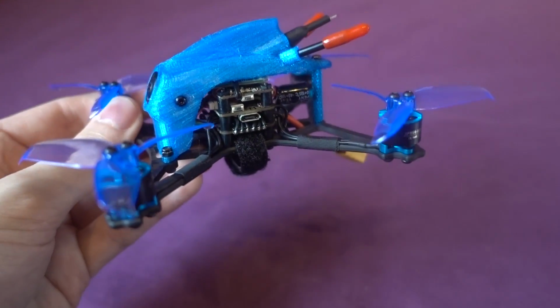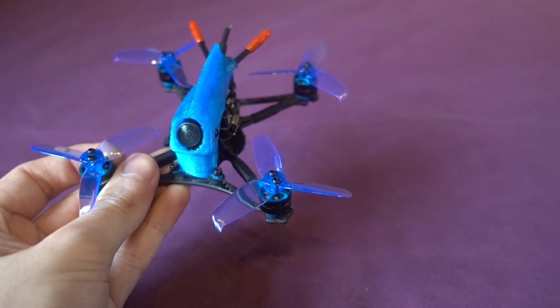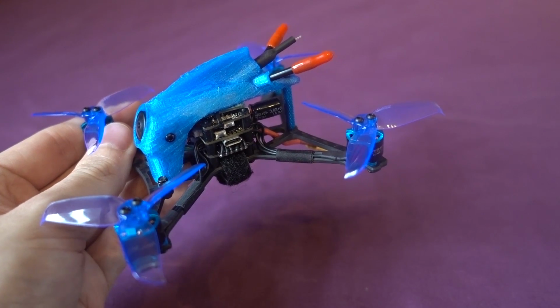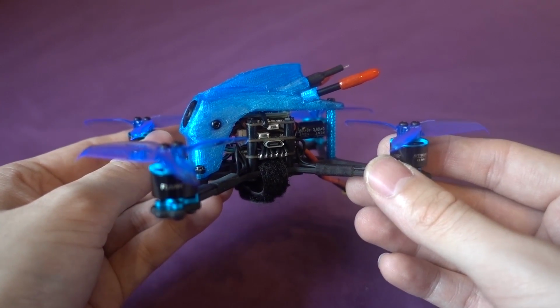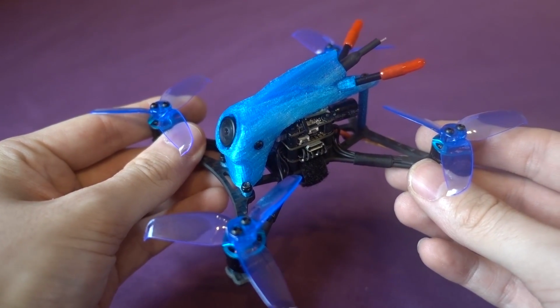But bear in mind, you can build 2 identical quads and the PIDs still need to be different. I haven't touched the filters because messing around with filters could be fine for my model but fry the motors on yours. So I don't tend to touch filters in tunes that I provide to the public.